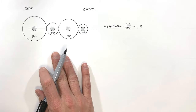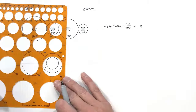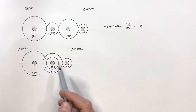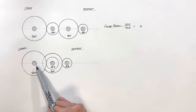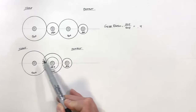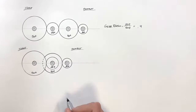Now there's another way to combine these gears — not in a simple gear train but in what we call a compound gear train — that will result in a very different outcome for the gear ratio. In this situation, we have an input shaft hooked to our 50-tooth gear. This 50-tooth gear is meshed with a 25-tooth gear, which in turn rotates around another shaft. This is not the input or output shaft — it's just some intermediate shaft in between. We'll call this the intermediate shaft.